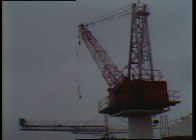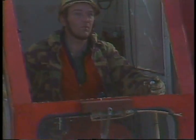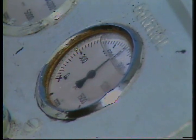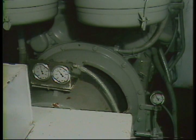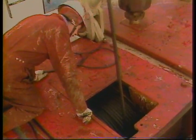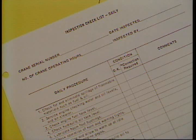The crane is one of the most useful tools on the rig, but it can be easily abused. Some safety measures you need to practice: don't ever smoke in the cab — in fact, don't smoke anywhere outside the living quarters. Make sure there's a fire extinguisher in your cab, recharged and ready to go. Before you make a lift, make sure your crane is operating properly. Get used to the sound of the engine — if it sounds abnormal, check it out. Make sure the controls are operating properly. Check the wire lines for wear and check the brakes as well. Most of this will be part of your pre-start checkout. There's a whole list of things you need to do daily before you operate your crane.